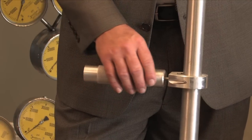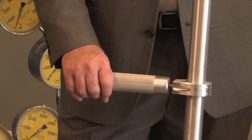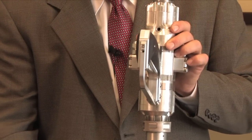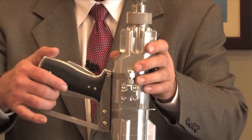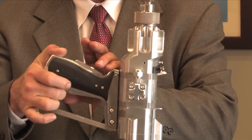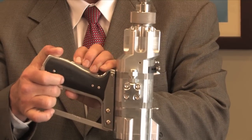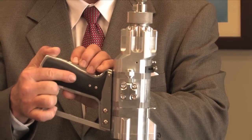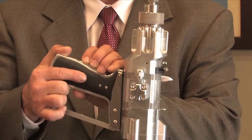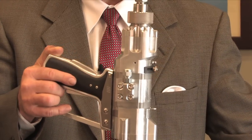There is no secondary trigger on the handle of the Hand Hog. From personal experience, I've found that my men's first thing they do is remove the trigger from the secondary handle. So what we've done on the Hand Hog is put in three triggers on the primary handle. Much like a Glock, you must first pull back the bottom trigger, squeeze the primary, then squeeze the secondary — three safety mechanisms all in one handle to protect the operator in the event they lose control of the gun, ensuring positive signal is sent back to the PowerPak and instantaneous relief of high pressure.